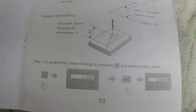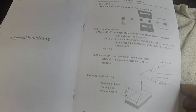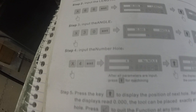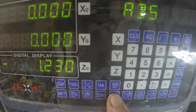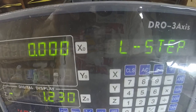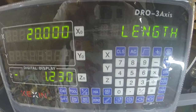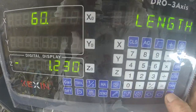Here's an example they use in the book. We want to drill a series of holes in a line 60 millimeters long at a 30 degree angle. The instructions here don't match — they're not correct, besides a couple of typos. But the way this works, you get into linear mode with this button. We want to check the length mode, not the step mode. We select length. Now it asks us what is the length — in the example, we want the length to be 60 millimeters. We enter that, go to the next field — we want it to be at a 30 degree angle, and we want four holes.